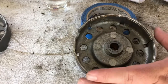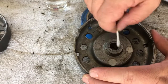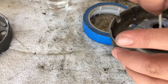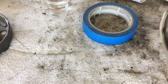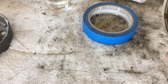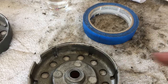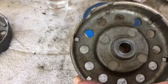I'm using a little rubbing alcohol — you can see there's definitely stuff coming off when you do that — just to clean what looks like the bearing surface where the washers rub up against. This is the rear of the housing and we do get some crap coming out of there. There's some stuff coming out of this little lip. I'm going to focus on what looks like the bronze bearing on the inside. That looks pretty good.